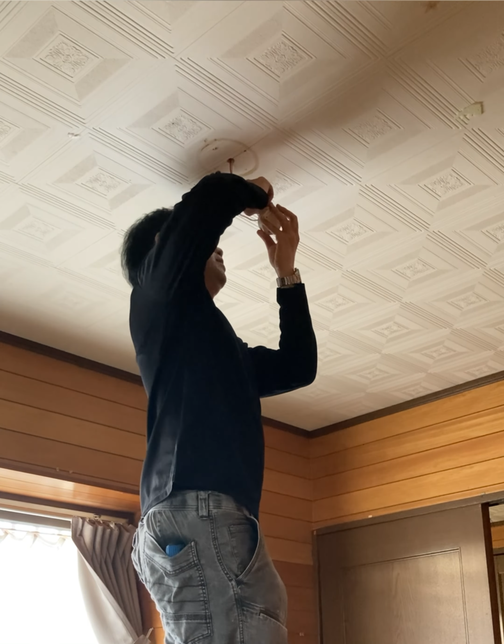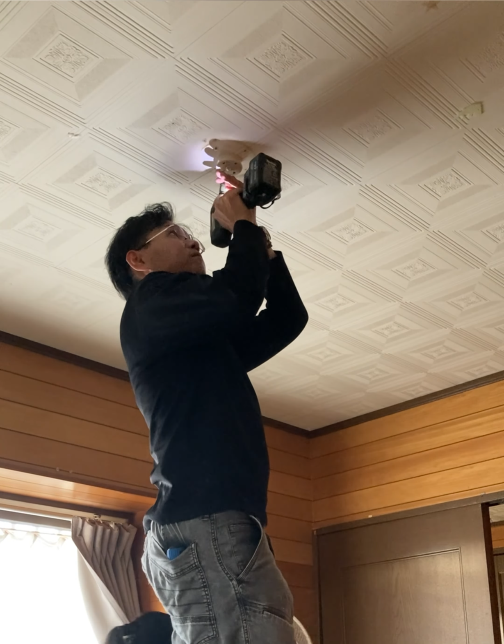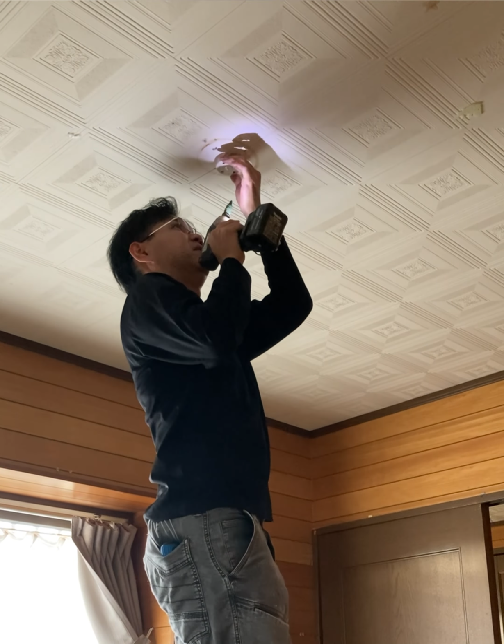After inserting the wires, secure the adapter to the ceiling. Here's a tip: pay attention to the ceiling material. If it's a soft board, screws may not hold well. In that case, you might need anchors or other hardware. Luckily, I found a wood beam behind the drywall, so I could secure it directly with screws.